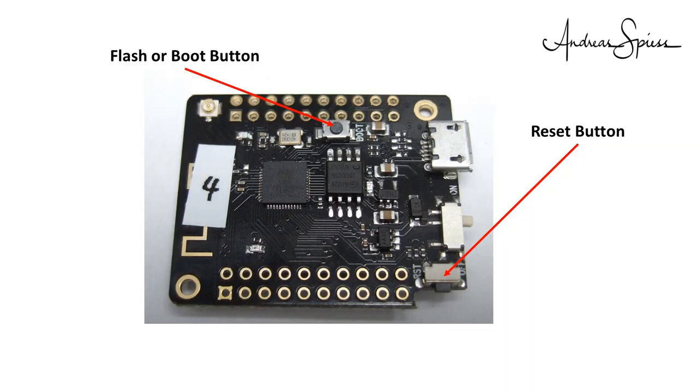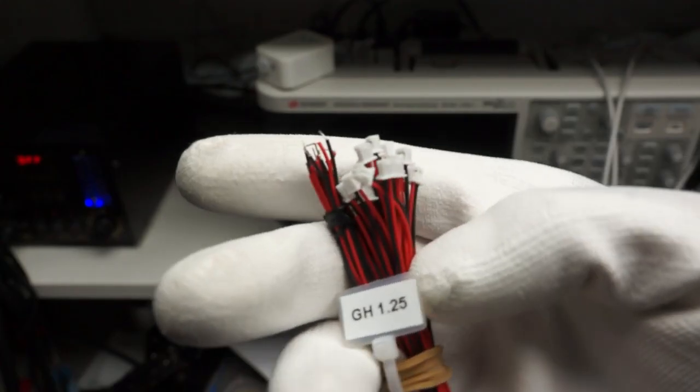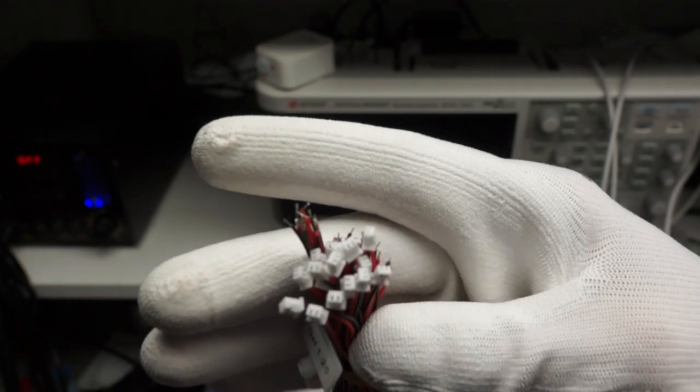And why does this guy always bother about the flash button? All boards have a reset button, and a flash button is not necessary because flashing is done automatically by the Arduino IDE. I have to admit, I like this button for quick tests because it is already there — that is the only reason I talk about it. Next, we check if a battery switch is available. Such a switch can be convenient because most of the boards do not have protection against deep discharge of your battery. If you have such a switch, you do not need to insert your own switch or disconnect the battery — with these small connectors, this is anyway not easy.